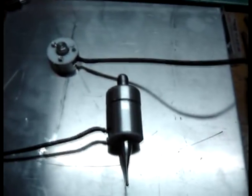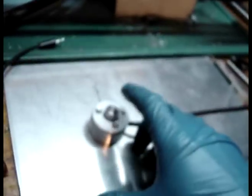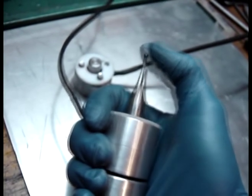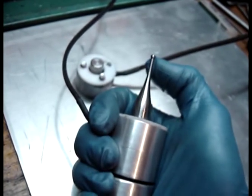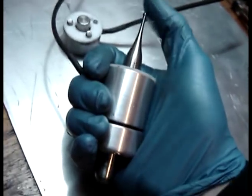I don't think I ever got a video of my touch probes here. These are based off of plans readily available on the internet, mainly CNC Zone and Mach support forums. I've got a touch probe and a touch plate for tool setting. They're both spring loaded, so that any deflection at all of this tip will result in a trip and will tell the computer that it just hit an edge.